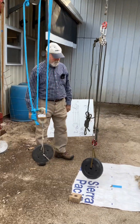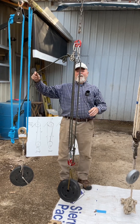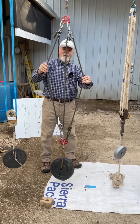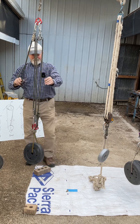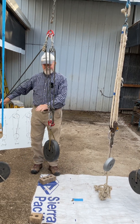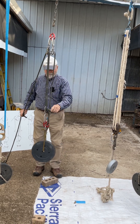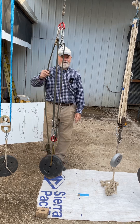Two to one. Another device moving up — you got a haul line and you got three lines supporting the load. The haul line here again does its number but it's not attached to the load. These three ropes carry the load. It makes it three to one.